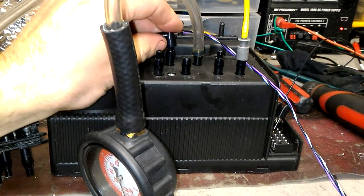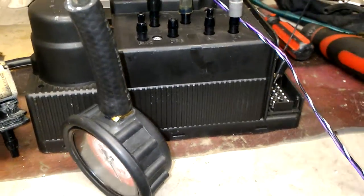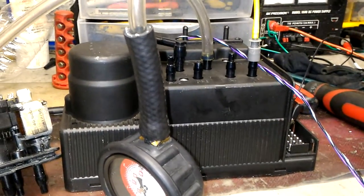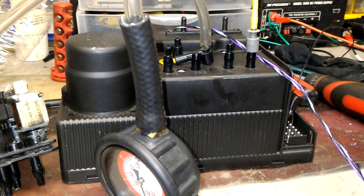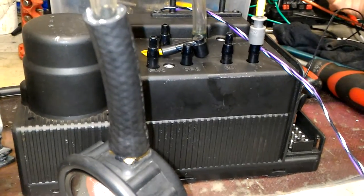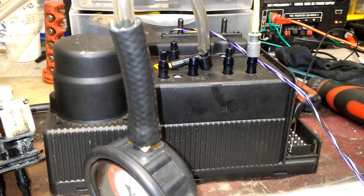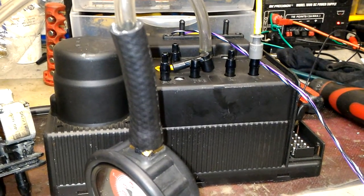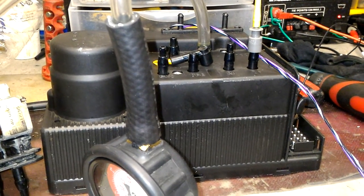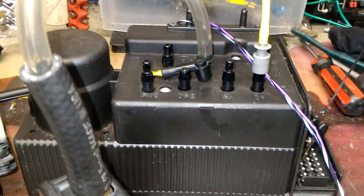The vacuum circuit is actually not working — the pump stored a code. Let's shut it down. It did store the code for the vacuum reservoir. Let's see if we can reset it; I might have to clear codes to reactivate the vacuum circuit. The vacuum circuit code is a hard code that has to be reset, or the vacuum pod adjusted. So I'm going to get to that in a minute, get that fixed up, and it'll be ready for installation back in the vehicle.